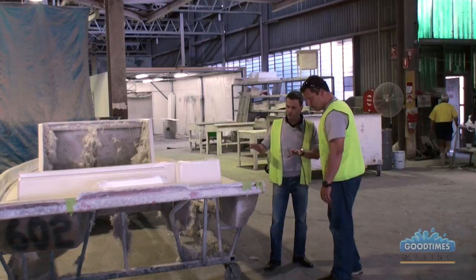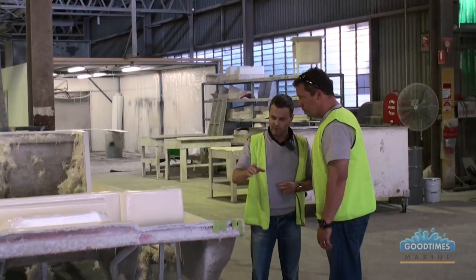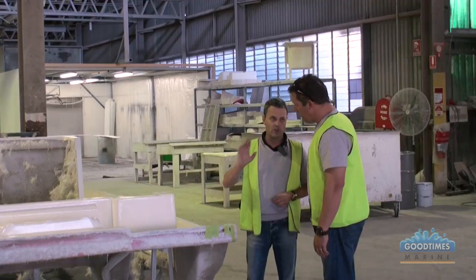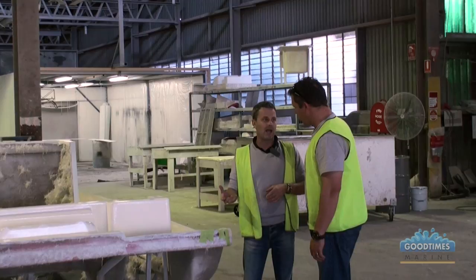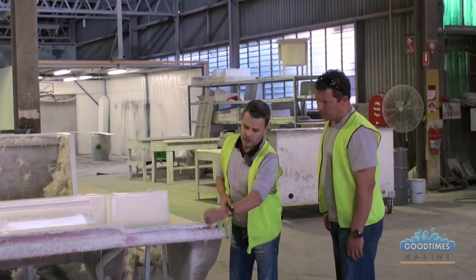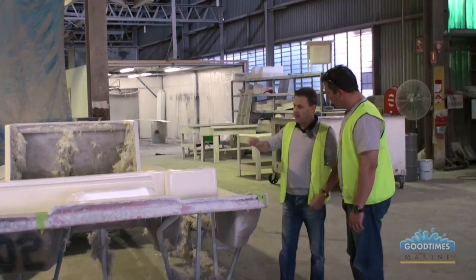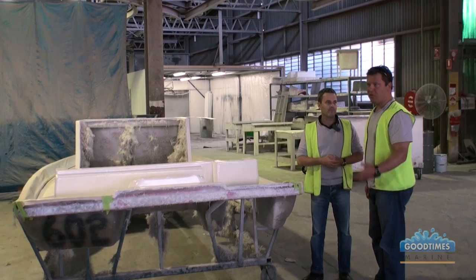What I've brought you over to show you now is a mould at the first step. For a two-tone boat, they've taped it up, sprayed in the gel coat bay — the white gel coat first. We do it opposite to cars: we paint first and then put the glass in behind it. We've got a female mould with a male part going into it. Once it goes hard, all of this tape gets peeled off, exposing the rest of the mould where we put the colour. So this could be a black or red boat — we spray that colour on, let it go hard, then it'll be moved over to the chopper gun.